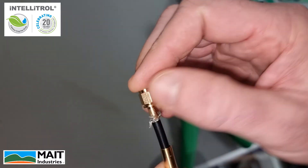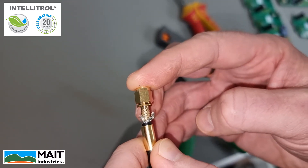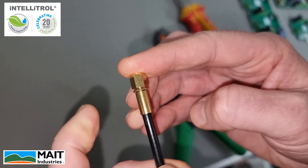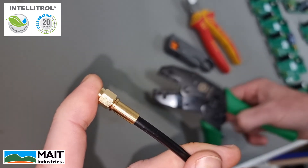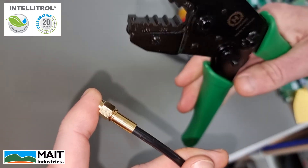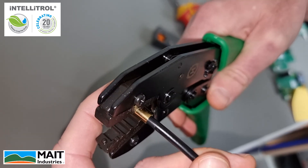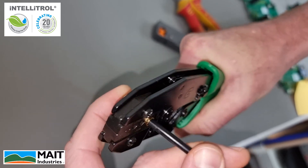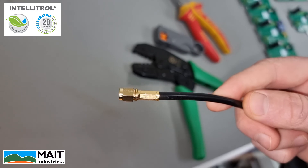Fold up all the insulation and shielding wire, then slip over the outer sheath, keeping some pressure on the top. Once it's all the way up, keep some pressure on the top between your fingers. Using the largest hole — the bottommost hole — line it up centrally and crimp it all the way down. And there we have a nicely done reverse gender male SMA termination.